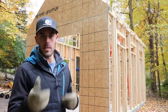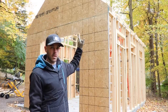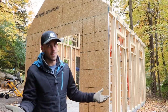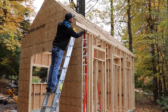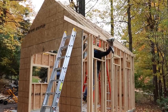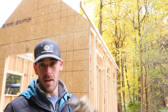The order of the next couple of things may not make a lot of sense right off the bat, but there's a method to my madness. The first thing we're going to do is put on the subfascia along this back wall. To do that, I made two brackets that I'll temporarily put in place underneath a couple of the rafters, just to help me hold this big, long two-by-four — again, because I'm working by myself. Yet another example of the ladder dance when working alone. The sheer number of times I've gone up and down a ladder is mind-boggling at this point.